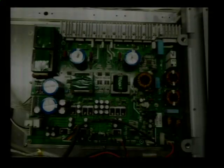So all right, this is the power supply out of that television. Anyone notice something big, those big four blue things? What are those? Right, those are caps. And that would be one of your first things to look for if this thing was dead. If you see a bulge on the top, that's also danger. Those things combined probably have enough energy to restart your heart. And that's exactly what's inside that AED on the wall of the hotel, probably about a dozen of these.